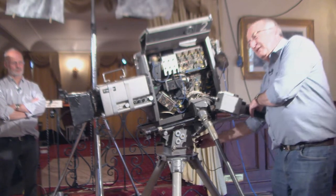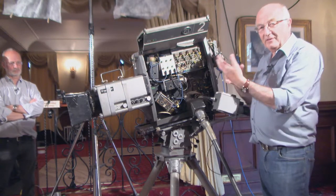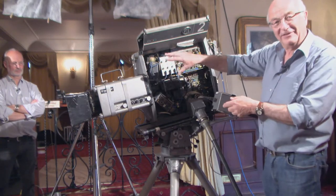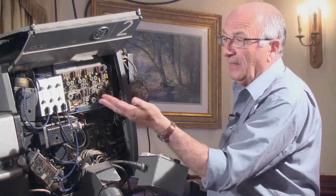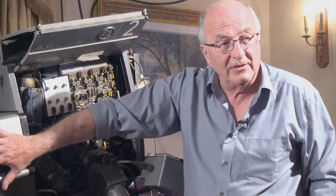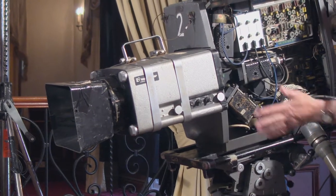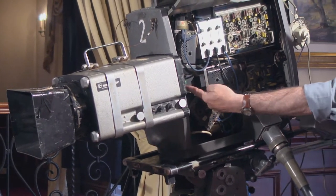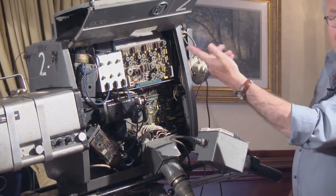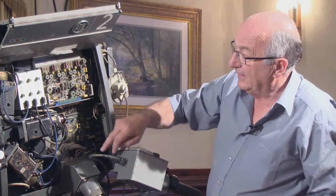To produce something you can transmit, they had to produce a black and white image, and your colour television at the other end fills in the detail that's been sent. But on this one it's all on one side - the works at this end don't go round. As you can see the lens hangs on the front, which is like most cameras - well, all cameras are today. Light comes in, split up just by the prism into red, green, blue. The line-up procedure is much the same - you've got the tube focus there and there, and you look at the same charts.